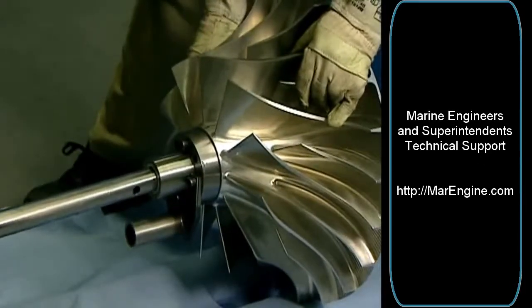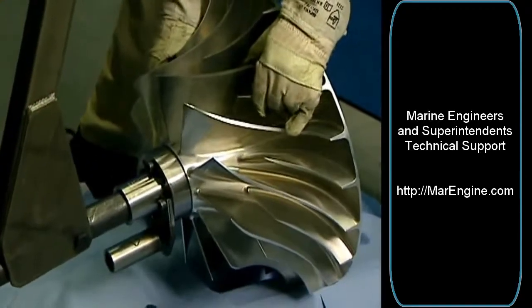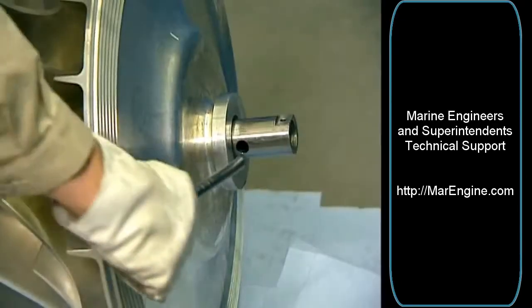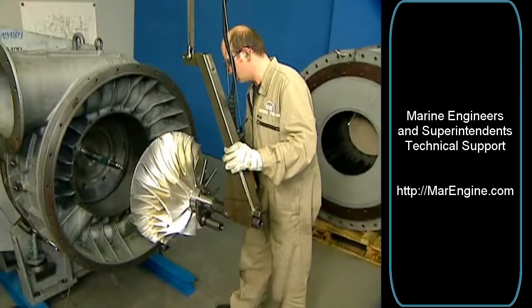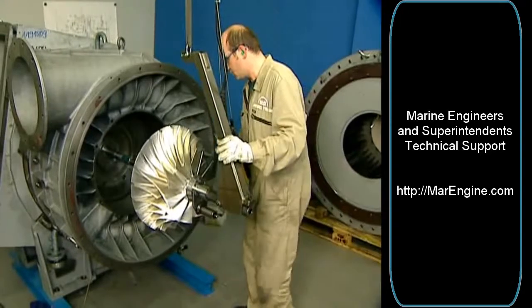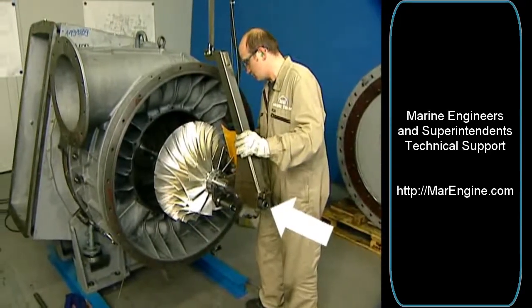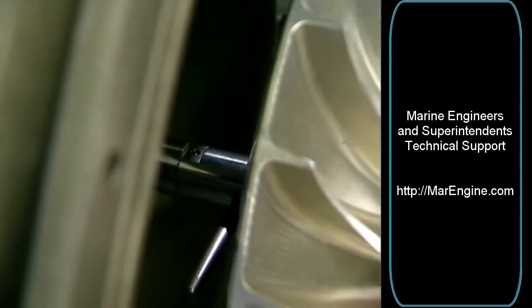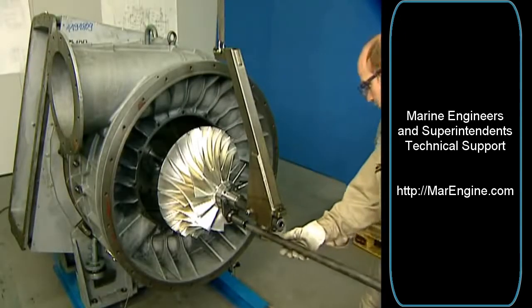Push the greased tube of the support through the slide. Secure the wheel with the turn pin. Align the tube and the rotor shaft horizontally, using the hexagon bolt on the suspension. Fasten the tube to the sleeve on the rotor with the pin. Pull out the turn pin.